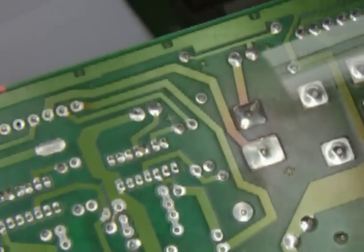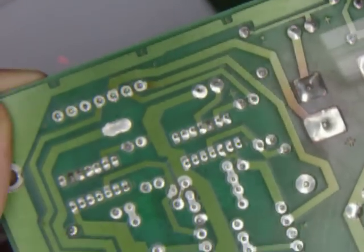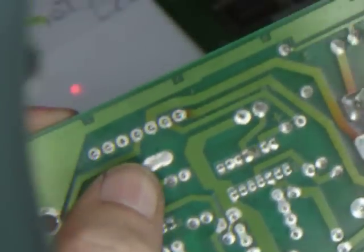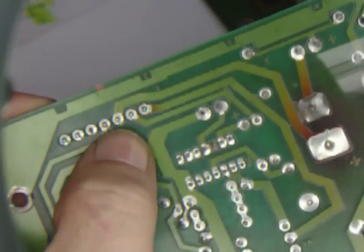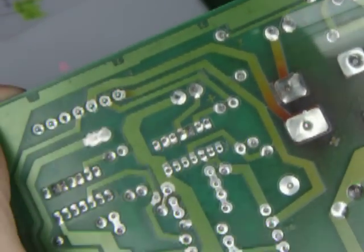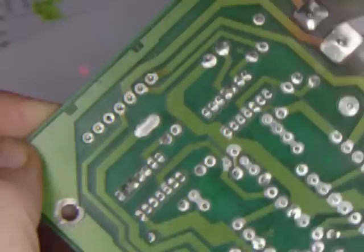Since this went so quick, what we'll do is we'll go ahead and solder this bad boy in place. Should only take a couple of minutes. And the one key thing that you want is you really don't care about the keyhole. The keyhole doesn't get any solder. The rest of the holes, you want to make sure that there is no gap in there when you're done soldering. So in other words, don't be stingy with the solder. Don't be afraid to put the heat on there.